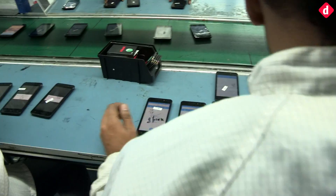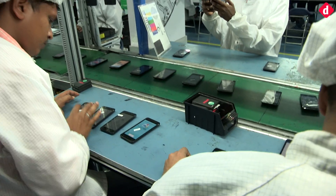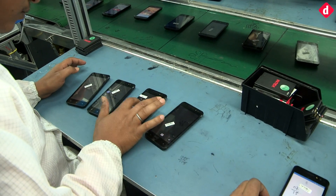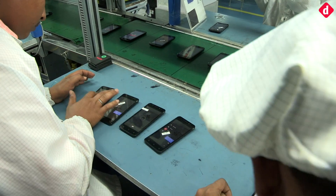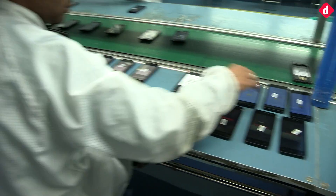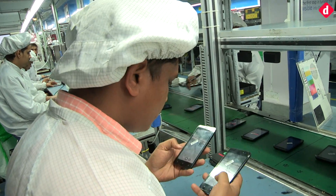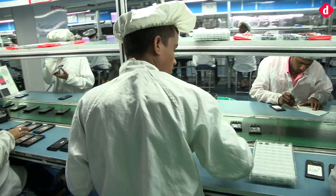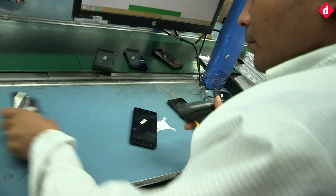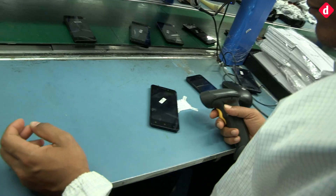This is our manual testing stage and this is where the product is almost fully finished. After the IMEI stage the product is complete and ready to be sent to market. But to reduce market failures, we are doing all the testing again a second time. All the testing which was done previously — auto testing — is now done manually again, including checking the camera, touch response, and IMEI verification. This is all done to reduce market failure so the customer does not receive any defect. The failure rate at this stage is very low — just 0.02%.